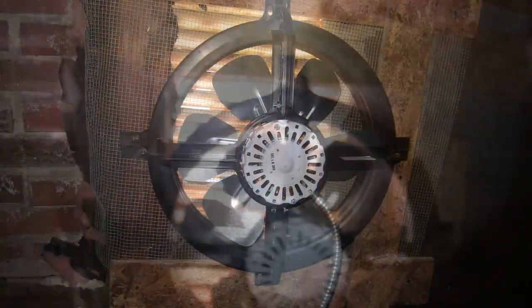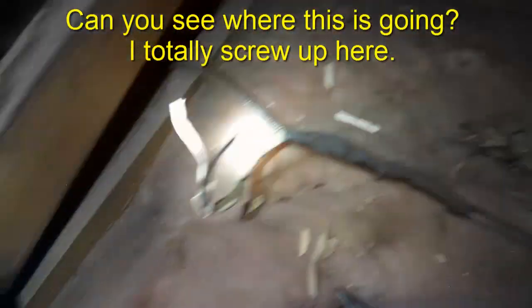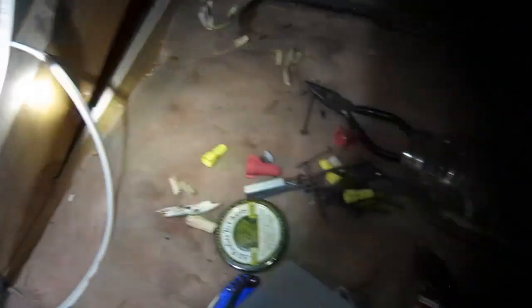Here it is mounted — it's not the prettiest thing in the world. I had a joist there and there, a stud there and there, and I had to gap it with OSB. It's just screwed in; the screws aren't really big enough but I wedged them in. Now I'm going to take some fabric and fill in all the gaps around it so it really forces air through. There's the fan, and I'm going to run the power from an overhead light circuit to our bedroom where a ceiling fan is — they already had a split there, so I'll put a box in and run the wire to the fan.